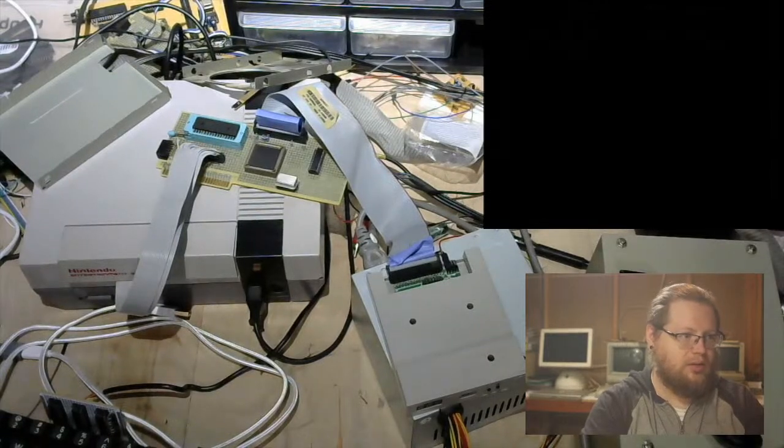CMD table. Okay, 0 is hello, 1 is enter monitor. Perfect. So a break, 4 bytes, and then a break, 01, 3 more bytes, and we should be good to not put anything after this because it should enter the monitor at that point. Should.